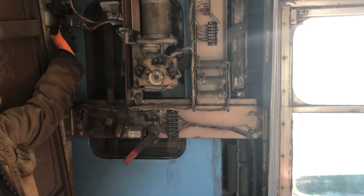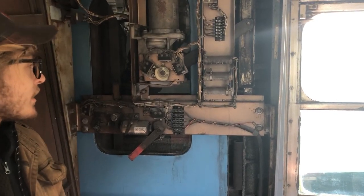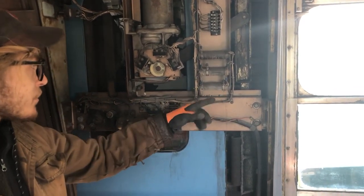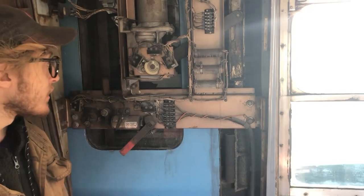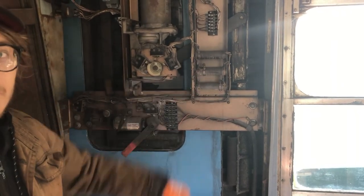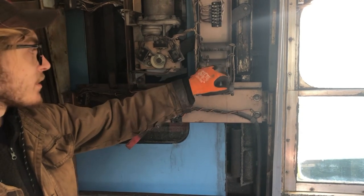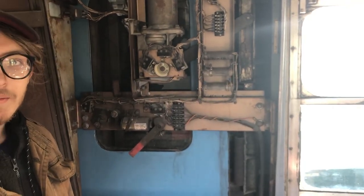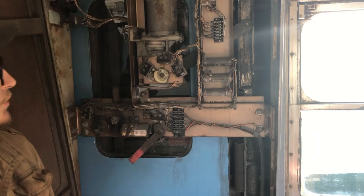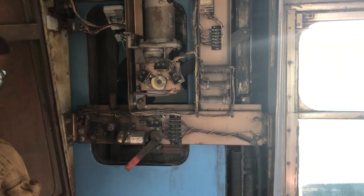That works like that, and that's your relay over there. The beauty of this is all the resistors — these are tube resistors, so they're calibrated. You can change everything if you wanted to: you can change where the sweeper is, because this is essentially a voltage divider. You get a percentage of the voltage at this point between the voltage drop here. Very simple, very robust. These aren't actually the original door motors — the original ones were believed to be air-actuated and located under the seats.